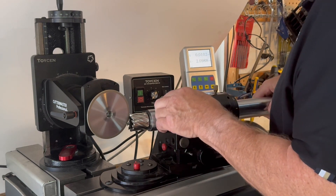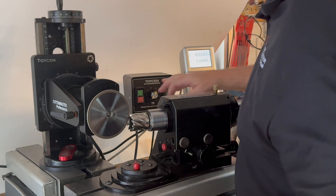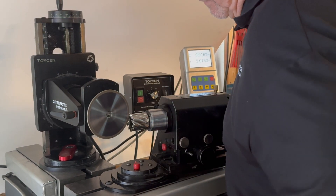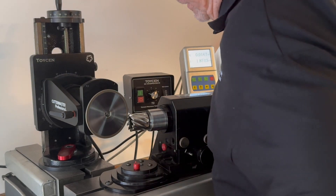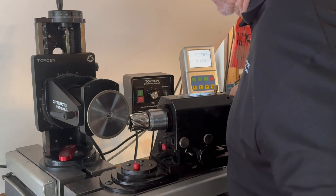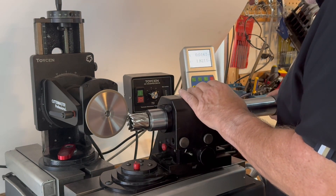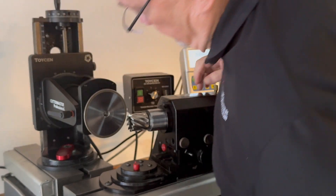We're going to feed with the table. You're resting against the front ring here, so it'll swing. Just come in to touch, then come across for the next tooth. Make sure you move that wheel far enough away so you don't ding. What I do is make my first position near the set screw on the indexing collar so I can keep track of number one. And now we're back to our first one — so there's your first grind.